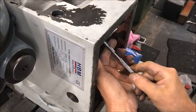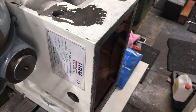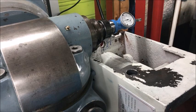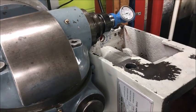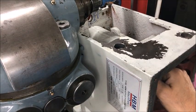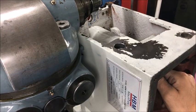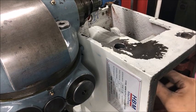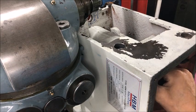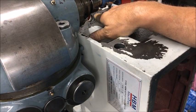I've also used a snap gauge to confirm that the bore on this side compared to what is here — the front or the down part — is slimmer on the rear part by around three hundredths of a millimeter on the radius, or six hundredths of a millimeter on the diameter. So that confirms the reading I got that it's a bit bell-mouthed to the bottom.